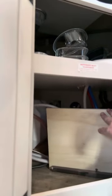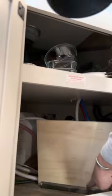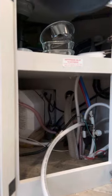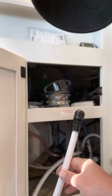The next thing I need to do is find my water pump. On this trailer it's located behind this panel — I'm not sure why they always put these panels here, but there's usually a screw at the bottom. Here we have our water pump. This one is really nice — it comes with an extra valve and an extra piece of hose. You can have these installed if your trailer isn't equipped with it. All I do is simply flip this valve, and instead of drawing water from the empty tank below, it's going to draw through this hose — we're going to stick that hose right in the jug of antifreeze.